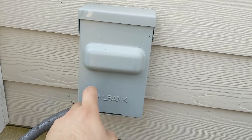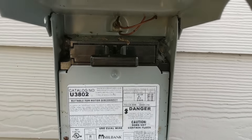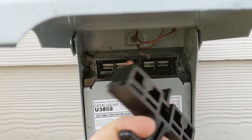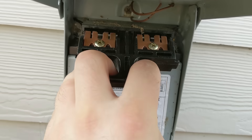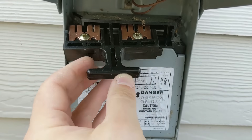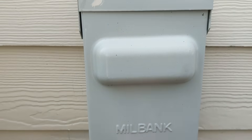This is the electrical disconnect for the mini-split. I've already turned off the circuit breaker inside the house, but inside here is another disconnect. What you do is pull this and flip it over — these copper tabs go into a plastic slot and don't actually make connection with anything. So that's a way to store it with no electrical connection.